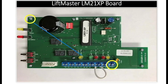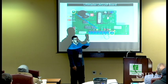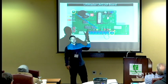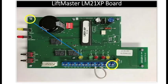Once that DC power enters the board, you'll get the right lights to let you know that you have sufficient power. You also have your reset and your test button over here. These terminals lined up pretty easy. Smoke detectors, and any regulated smoke detector or alarm system that's set up already with resistance set into it, meaning it has like a 10K ohm diode or it has a resistor or something because it's monitored, that is going to connect to 3 and 4.